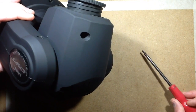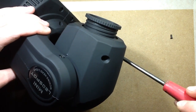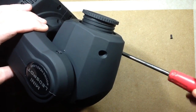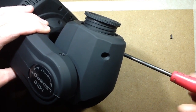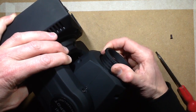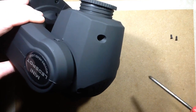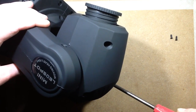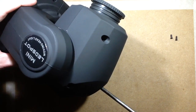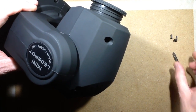I have to say, it's not something I'd use in a big theatre or a concert, or, well, if it was a small concert, but certainly for nightclub use, it's really impressive. It's got very well defined beams. The focusing is done manually from the front. It's fixed focus, but once you've got it focused, it cuts the air nicely. If you've got a bit of haze in the air, it's really surprising for a fixture with just an 8 watt LED.